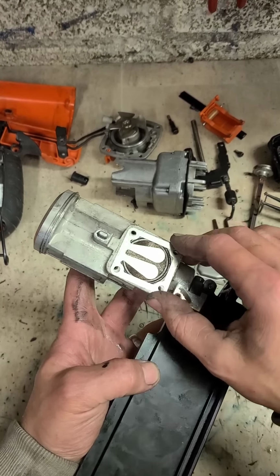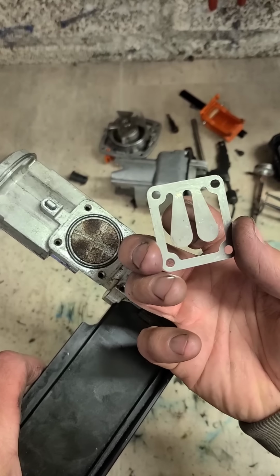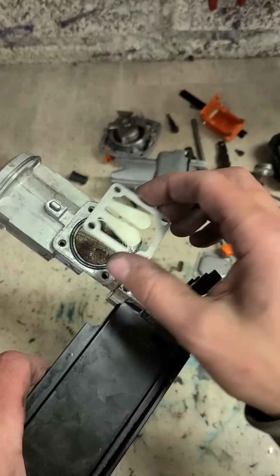Nah, it's not a manufacturing fault. It's a repair fault. Somebody's just rebuilt this wrong. I know it's not a manufacturing fault because of that gauze. That's the filter for the exhaust. As you can see, there's 4 marks on it. In other words, that has been moved before. So someone's had this out already, maybe during a service, and flipped it round. Whenever they've opened it and put it back together again, they've put it back together wrong. So they've done that, which is incorrect.